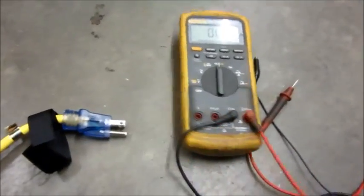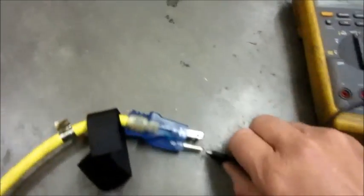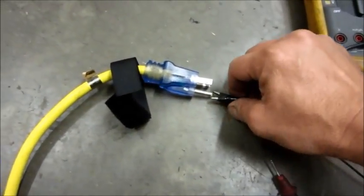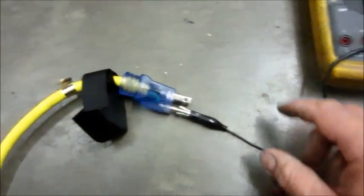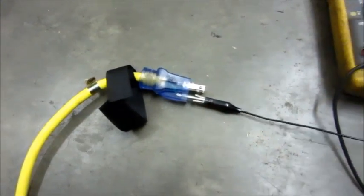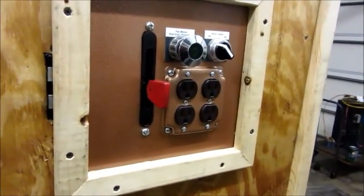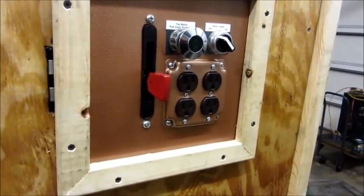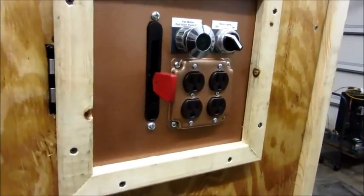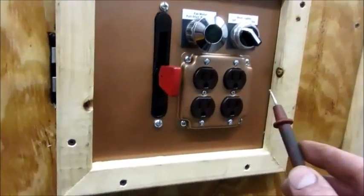And that's the entire electrical system done, so it's time to do a safety check on it. I have my meter set up for continuity buzzer mode, where it'll beep if I've got a connection. What I'm going to do is connect this to the ground pin, or PE, on the cord. So anything I touch that has continuity through to the ground pin, I'll get the tone on the meter. Every part of this thing that could, in theory, get shorted out and become electrically live and shock somebody should be grounded.